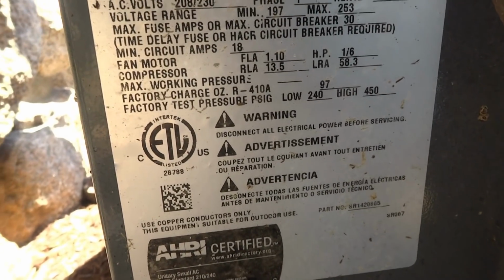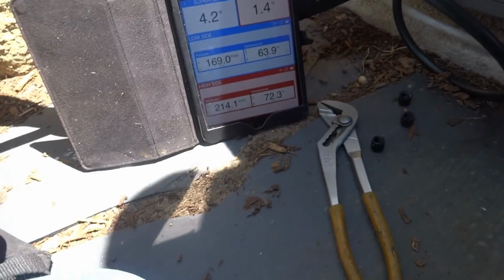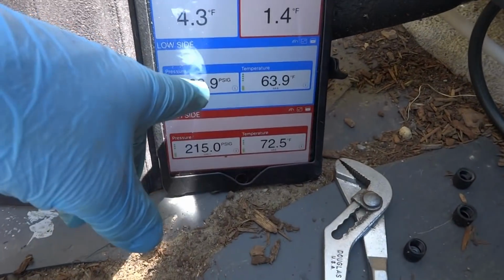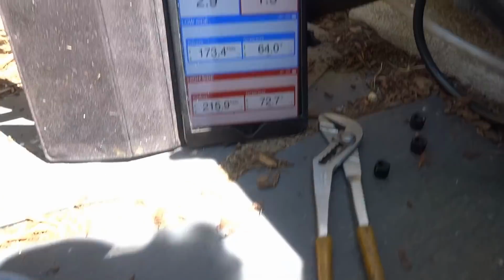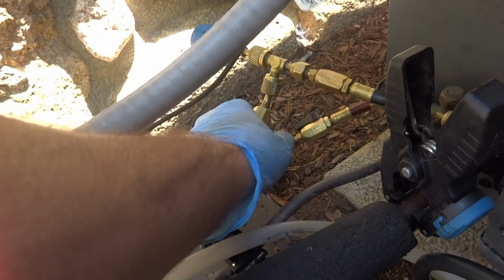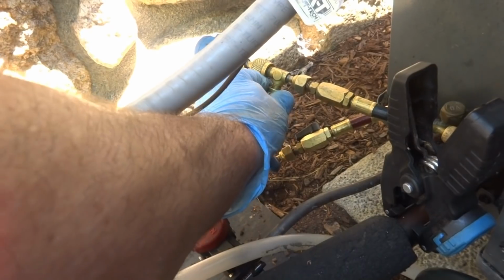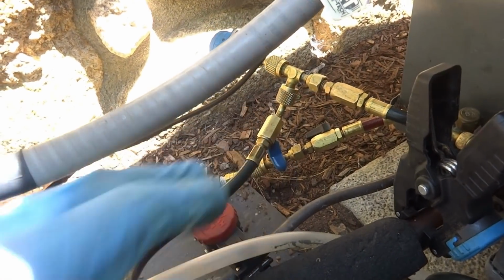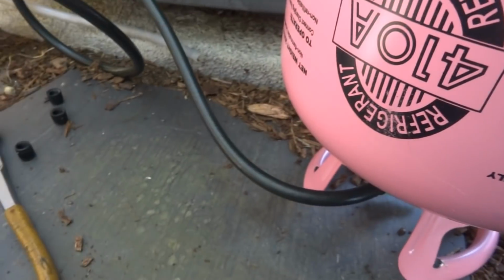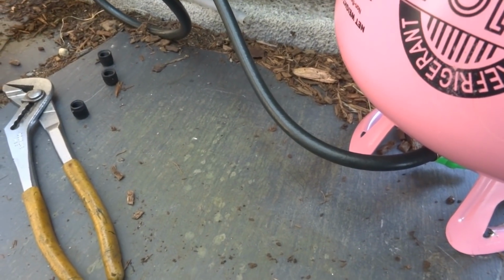This is a 410A system. This is a 2-tonner. You did say this was 2-ton. Yeah, they told me it was a 2 and a 3. Whatever. Suction pressures, definitely. Yeah, because they're supposed to set it by subcooling if it's got the TXV. But we'll give it some gas and we'll see. Once we get it set, it should start giving you hotter air out the top.